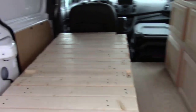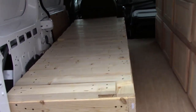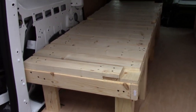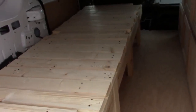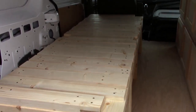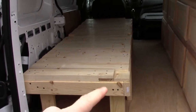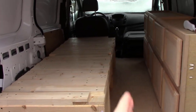We got the bed in — it is a pullout and we got the pullout working. At first my pullout was really stiff and hard to pull out, but I put a shim underneath each end when I tighten it down and that made a huge difference. Now I can actually pull it out by myself. I'll show you the pullout later — it's kind of a two-person job, one person on each end — but it'll pull out almost all the way over to these cabinets, which is really nice.